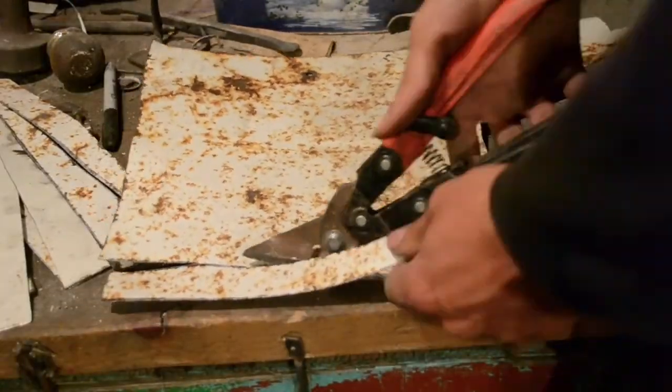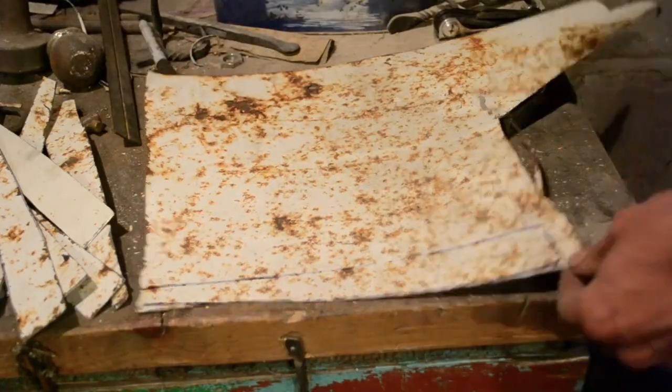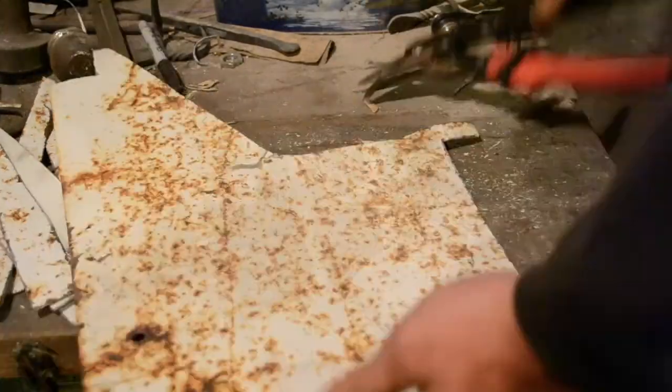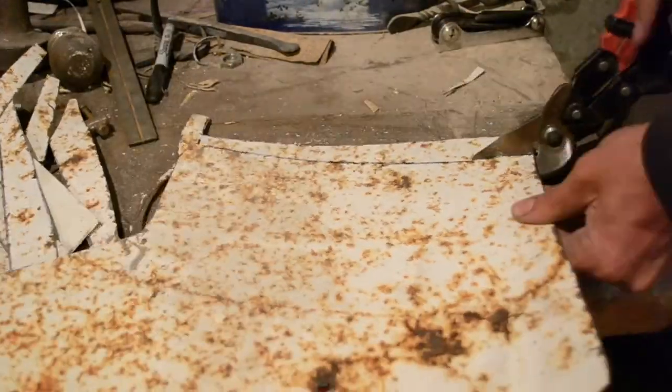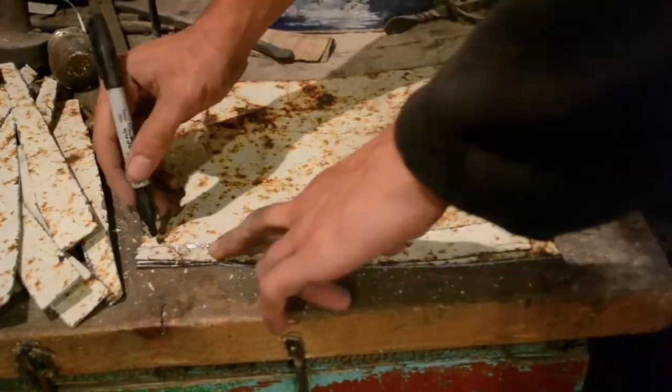At the bottom of each piece, the 2 edges are parallel for about 3 inches before the taper begins. The reason for this is that if the whole piece tapers, what you'll end up with is a cone. As most of us don't have cone-shaped heads, this really won't do for a helmet.